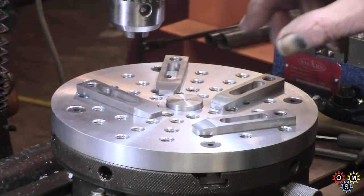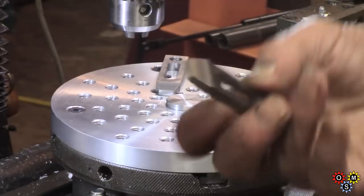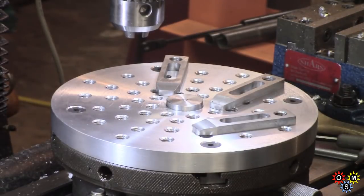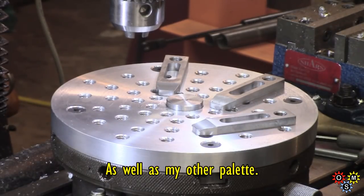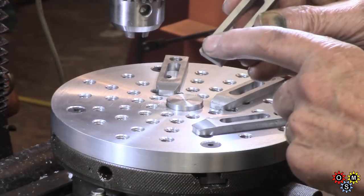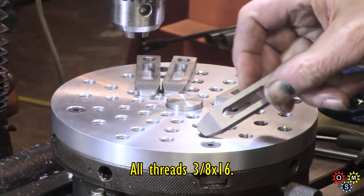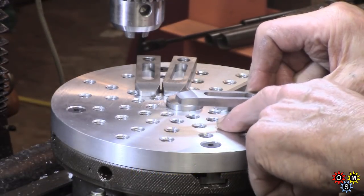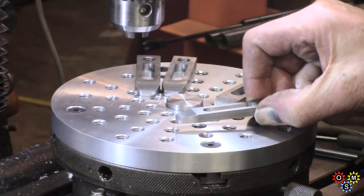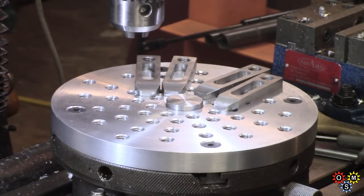I did mean to add, some months ago, I think it was early this year, I can't remember, I made a set of four little mini toe clamps, and this is what they will be really needed for. One of the reasons I made them anyway. The threaded hole at the rear is for a jacking bolt. So in use we would have one bolt into the threads on the turntable, and then a jacking screw bolt at the back to get the right angle. So we'll probably try those out at some point.